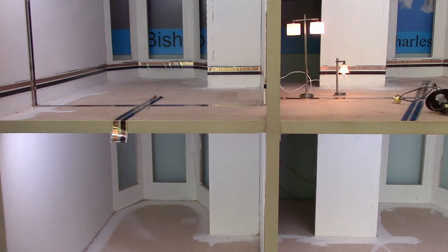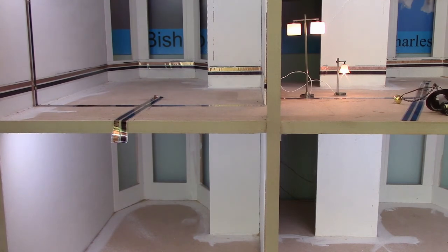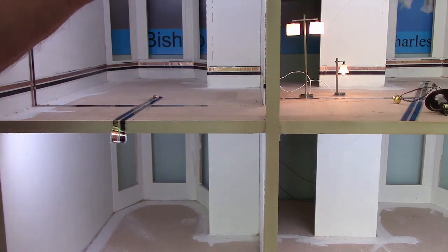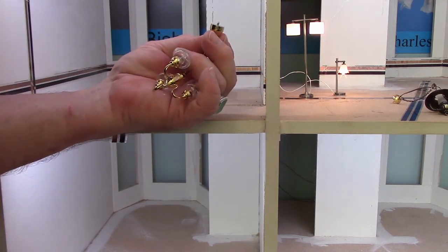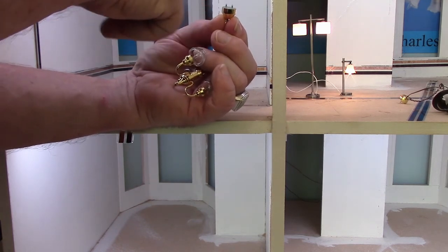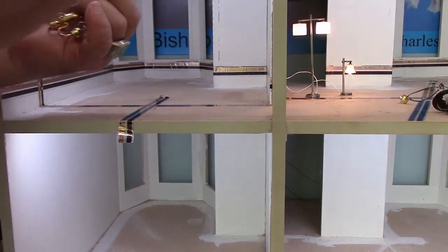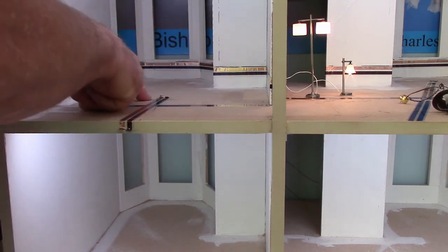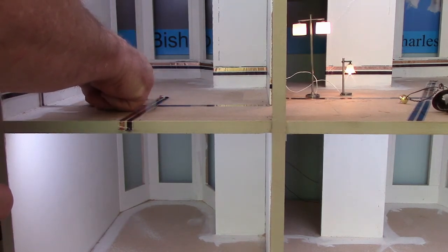The difference between that, the ceiling plate adapter, which uses the micro jacks or the spring-loaded eyelets, and the other ceiling adapter, the ceiling canopy adapter, which has a different configuration. It also has a much bigger pin. I'm going to go ahead and just screw this into the light fixture so you can see the pin that's on here. What I do when I have this one is I don't need to use the micro jacks. The micro jacks are too small for those nails to fit into, but I can come down with a bare wire, lay it across the ceiling and push this up and glue that cap into the ceiling, and then lay my wires across the valley that we routed out here and solder them down into place.